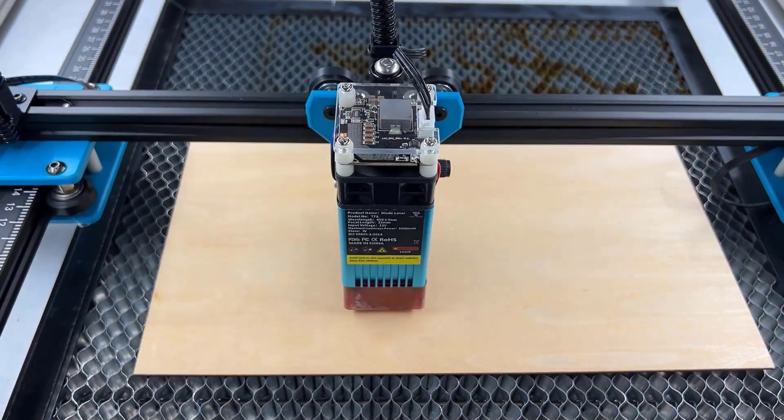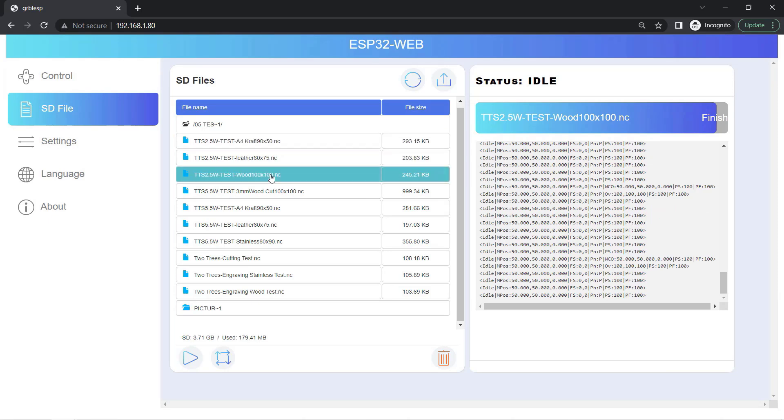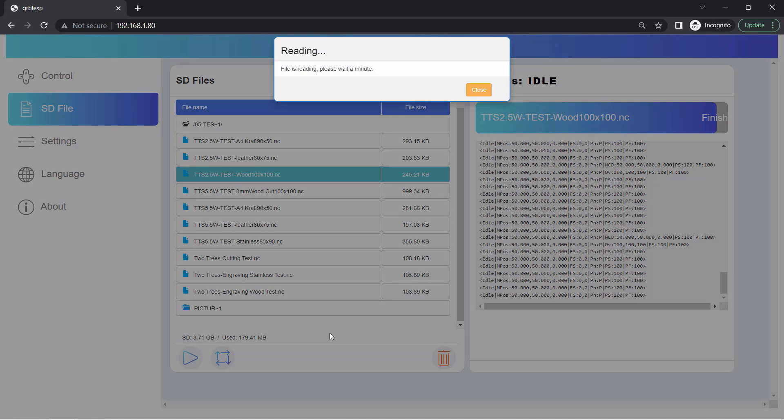This machine uses the MakerBase ESP32 engraver motherboard and should also support WiFi. I've tested other machines with the same board — the WiFi feature isn't perfect but works okay most of the time, except for engraving photos with large file sizes, where it may take 3-4 minutes to upload a 25MB file and another 2-3 minutes to draw the preview frame. For files a few megabytes or smaller, it's totally fine. The manufacturer could consider releasing firmware to better utilize the ESP32 WiFi feature. If you work with small-sized projects and require a powerful laser for cutting and high-detail photo engraving, you can definitely look into the Atomstack P9. I've put links to the machine, laser tent, honeycomb bed, LED lights, and other 3D-printed parts in the description. That's it for this video — if you liked it, please hit like and subscribe. My brother and I make a new video every weekend, so check back on Mondays!